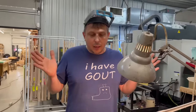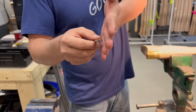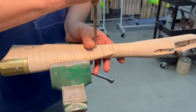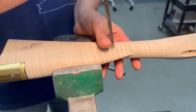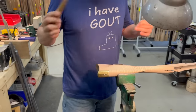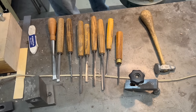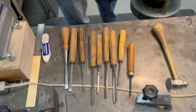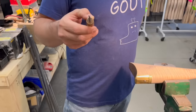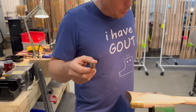To outline your carving or create a V, there are different ways — you can use a knife, a V-tool, or various gouges used in combination. You pick the ones that match, go around the line with your gouge, and stamp it in — that's one technique. It works very well but you do need a lot of tools; you might need 12 or 15 different gouges to really do a good job of outlining your carving.